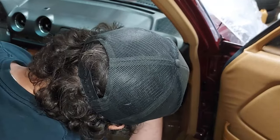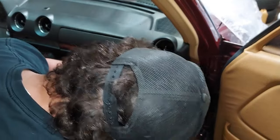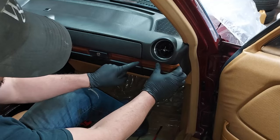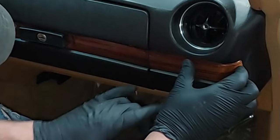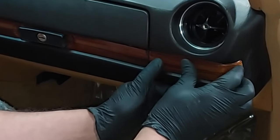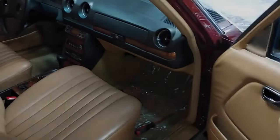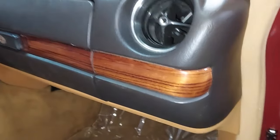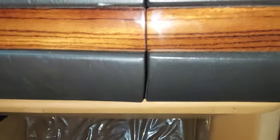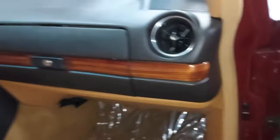Position it perfectly — you want the wood grains to almost line up perfectly right here, so the grains are very close together. Hold it in place where the super glue was for about 60 seconds. About a minute later I removed my hands, wipe off any dirt, and now it's held in place while the epoxy dries. See how I got the wood grains to line up with each other — that's how you want to do it.